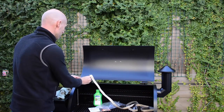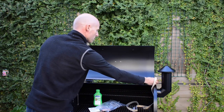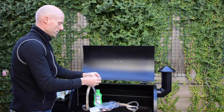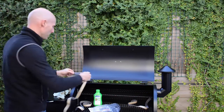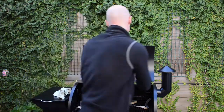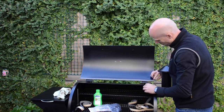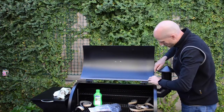We'll measure it up and stretch it a little bit. I'm going to cut it right there with a knife. Don't breathe this stuff in, it is glass. Don't peel it all off at once, just bit by bit. Okay, so that's going to be a little bit long, so we'll trim the end off that. It's because if you pull it, it'll stretch a little bit.